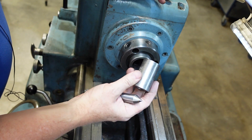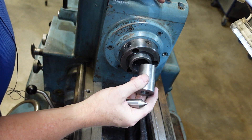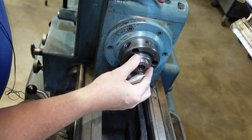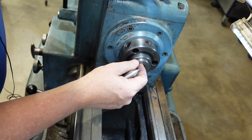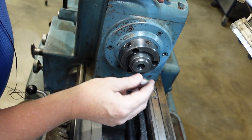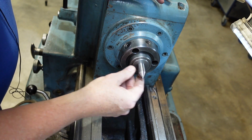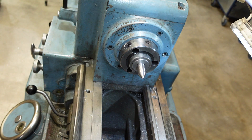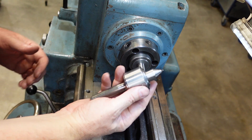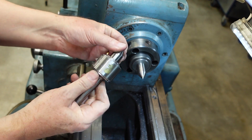To use them in most lathes you use an adapter. This is one I made up for this lathe, and as I mentioned when making one for a friend, the cam lock cams can interfere with that — but basically it will sit in there like that. In the tailstock I've got a live centre; this is a ball bearing centre.